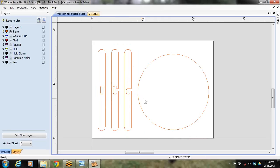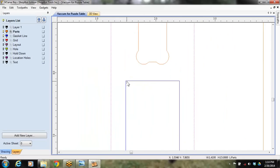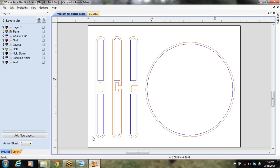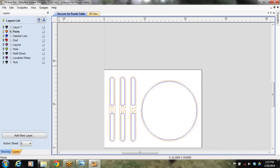This is where I drew the parts and got them to the size I wanted. Then I said I need some sort of a gasketing line underneath — which is where this black gasket goes. I started drawing the gasket line at a certain distance away from the actual part profile, because I need the gasket to be inside the part's profile. If I have it at the same edge, the bit would cut into the gasket and you'd lose your vacuum.